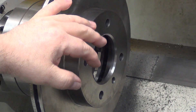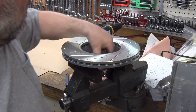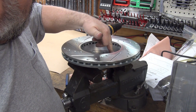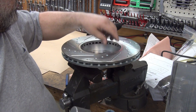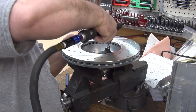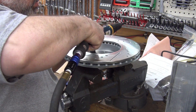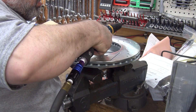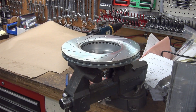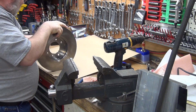It's always nice when you do it the first time and you don't make a scrap part. There's that burr I mentioned on the inside — this one's not bad. I wouldn't have sliced my fingernail like the other one, but there's also on the face around the holes, little burrs, and burrs in here as well. So I'm going to hit the edge of the big circle, hit all the little ones, and that should finish this rotor off perfectly. That rotor is finished — I'm super happy with that fit, it's so nice.